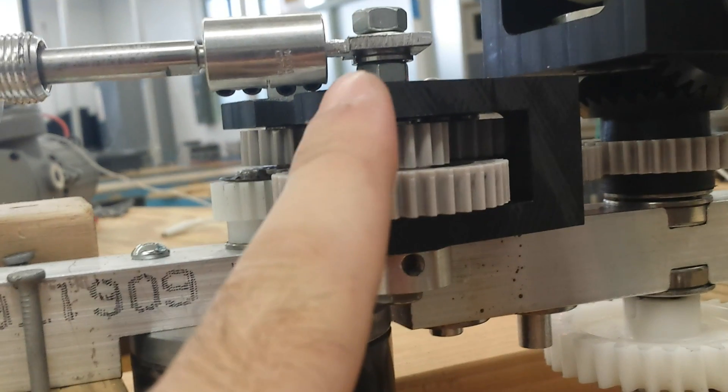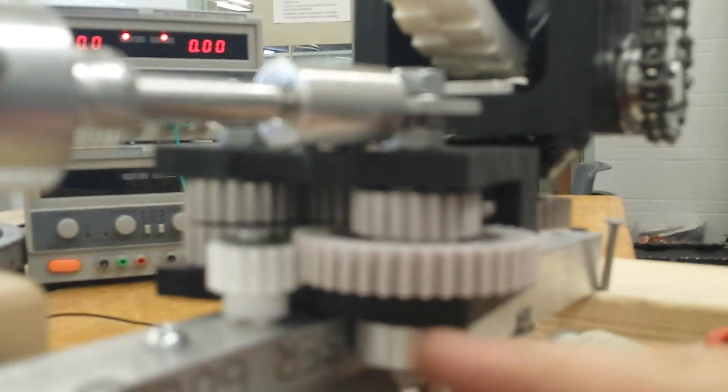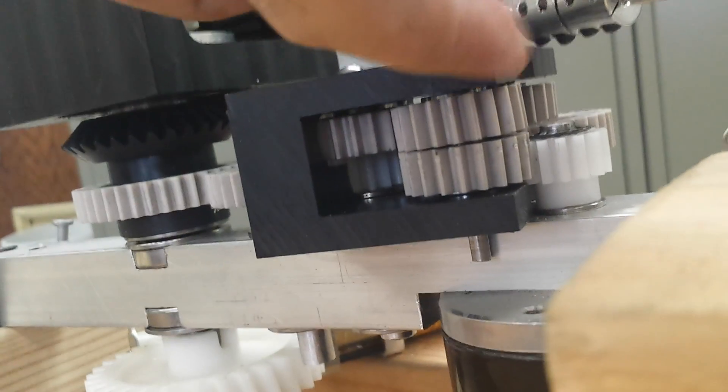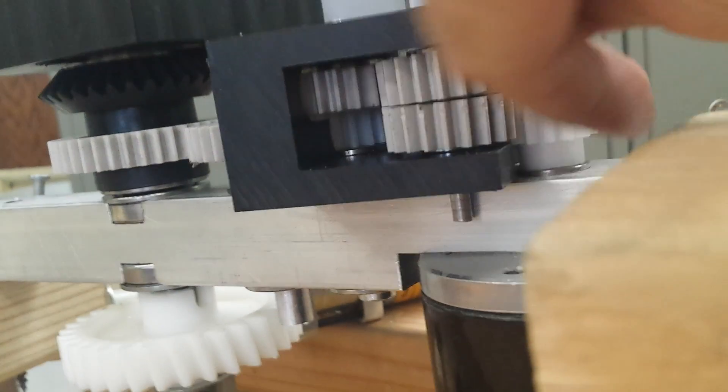However, there was one very simple modification I did, which I knew I was going to do since the start, and this makes it so that no matter what the pressure is, the spacing will always be perfect when it's engaged either way. The little trick is this guy down here — on this axle that's for this cluster gear, we put a specifically sized spacer. This spacer ensures that when it's engaged and butted up against the aluminum channel, no matter how hard the piston is pulling, the spacing will always be perfect due to the spacer on that same axle. So no matter how hard this piston pulls, these gears will never bind. And the same thing for the opposite side — on this side I just took the axle and machined it down, because when it's fully engaged it was actually too big of a diameter. All I had to do was reduce the diameter down, and now no matter how hard the piston pushes, it provides the perfect spacing and these gears never bind.